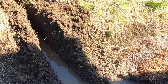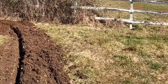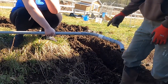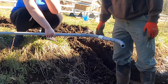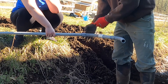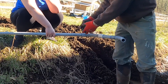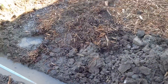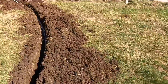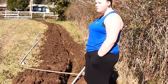I got the trench all cleaned out. You can see the water on the downhill side. I got the dirt compacted on this side of the curtain drain and smoothed out the other side so the pipe just lays in nicely. I added a coupling — here's a 45, more of a sweeping bend for the fiber optics. When you go to glue it, put the cement on one side first so when you shove it together the residual isn't flowing inside the tube. If you put it on both ends, as you shove it in there's a bunch of excess inside. Alright, we've got some of the pipe in. I've got my helper and I'm working my way around, trying to get a whole bunch of it laid before I start backfilling.